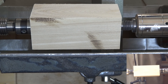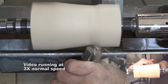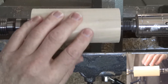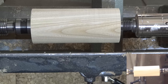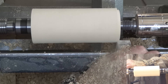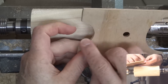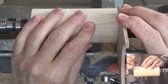First thing I'm going to do is round this over using my spindle gouge, turning at 2000 RPM. Close enough to round — now I'm going to put a tenon on this end so I can reverse chuck it. I'm going to use a peeling cut with my skew chisel. This is my go/no-go block. One end has one size radius, the other end has another, and as long as it's between those two I know it's going to fit in my standard jaws. So that's ready to go.